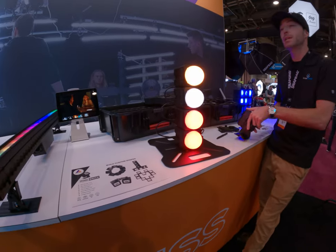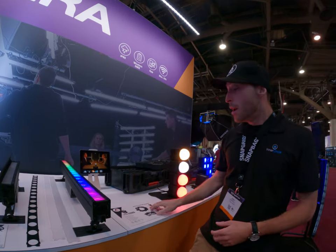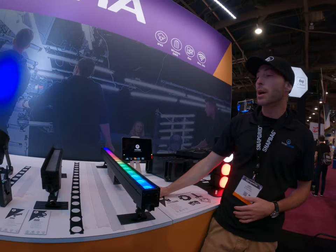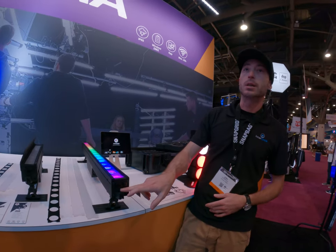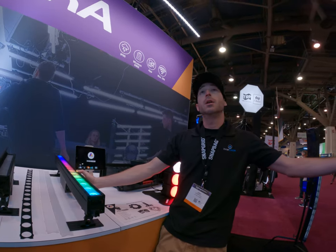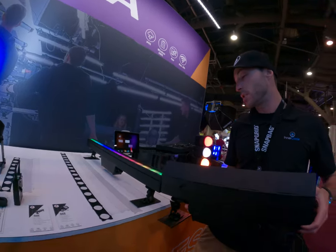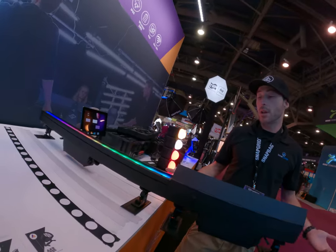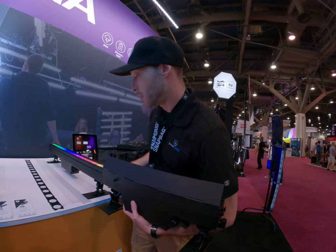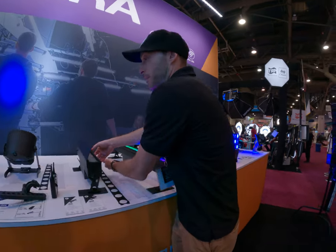The AX2 is going to operate off the same airline track structure — feeder modulars, you can go all the way up and down the whole unit. It's got power in and out, as well as battery and near infrared, so you can share commands. Hit a button, assign address one, and it automatically knows how to offset. There's also a big beefy locking bracket here, so if I needed to extend the unit just a little further I could — it can support its own weight, very rigid and structurally sound.